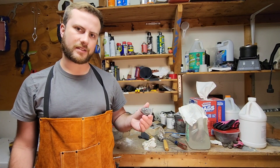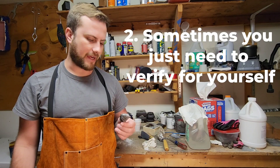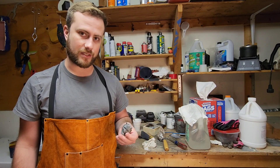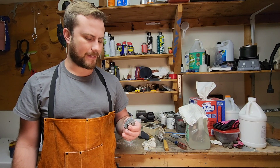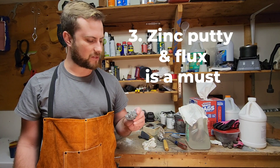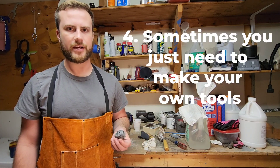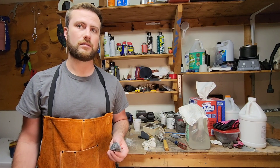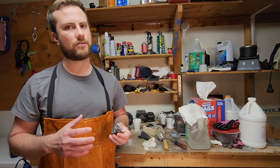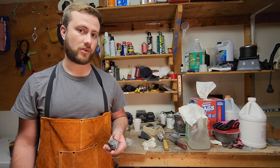In summary, I'd like to give the highlights of what we learned. The temperatures needed are quite a bit higher than what some literature out there says, and that could be because they generally do sintering in an atmosphere and under vacuum, or it could be the different type of aluminum we're using. We also learned that without the zinc putty and without the flux, this doesn't really seem to work. I've also learned quite a bit about producing the elements and crucibles for this project. The microwaves themselves are quite large, so large crucibles work well, but a smaller compact crucible might be the ticket for more exotic materials or different steels — and perhaps titanium, which is on the list.